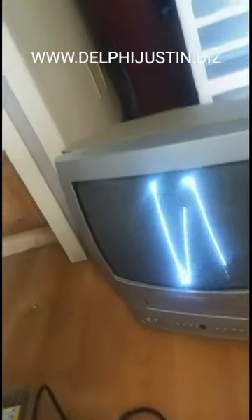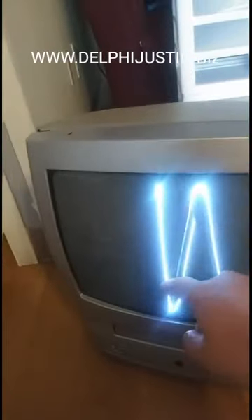As you can see, the sine wave looks pretty good - well drawn on this TV screen. You could add another transistor for a sawtooth, but I prefer to use just one since it's not required. Basically what this is doing is plotting a single signal in XY mode. Everything is done in XY mode because the sawtooth makes the waveform plot on the screen, just as you see it.